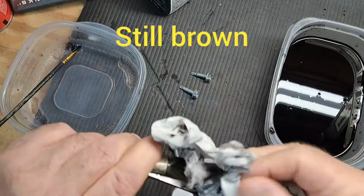Number 4, it was much more effective to use the dye full strength. And I would say that's a good way to save your dye too, because it doesn't take a whole lot of dye with a paintbrush to apply it here. That's a really cost-effective way, and it worked the best, frankly, just putting it full strength directly on here, and it worked just great. You can see that. And you even got some good speckling here. So cold dyeing works. Full strength application is the best if you're going to do that.